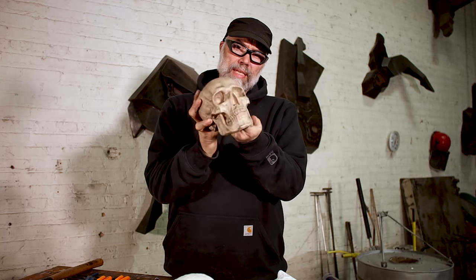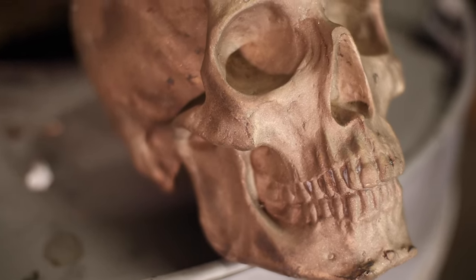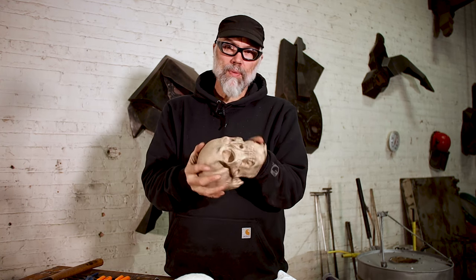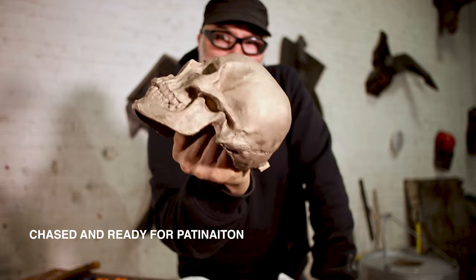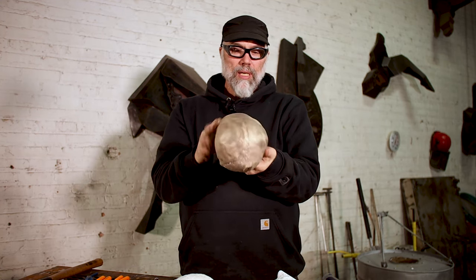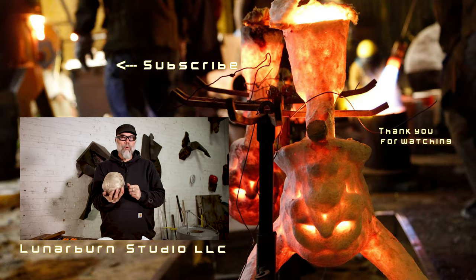De-invested and sandblasted, we can see that we actually have a pretty decent casting. There are definitely things in here that are not ideal — some little bubbles of positive metal, a couple of random tool strikes. It's hard to tell whether some of them were actually in the wax, some were from being too aggressive during this demo, and a few things I put in here on purpose so we can talk about how to fix things. The next video, we're going to talk about how to make this pretty: the correct way of grinding down our gates and making them flush with the material, taking away any positive metal, and then setting it up for a final sandblast or ways to clean it up and prep it for patination.